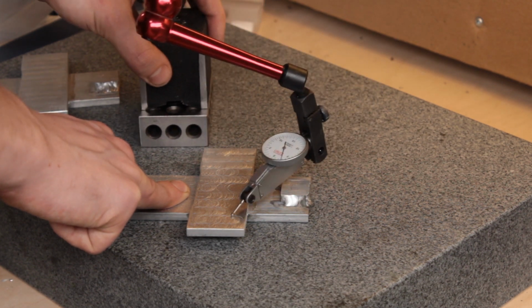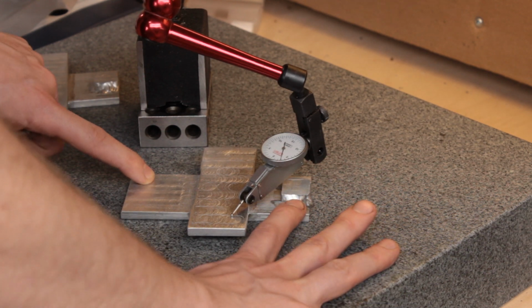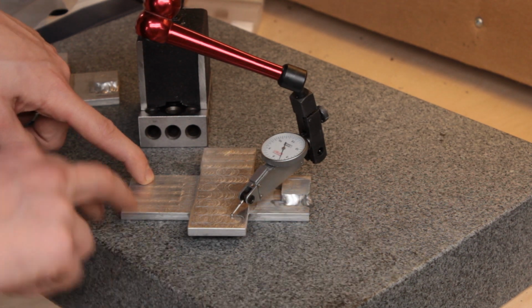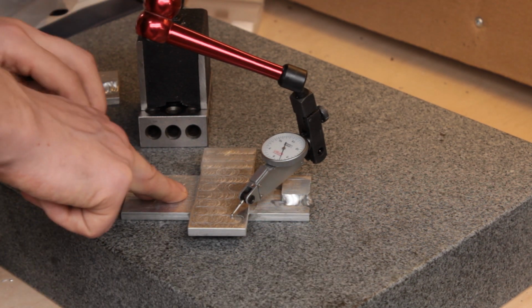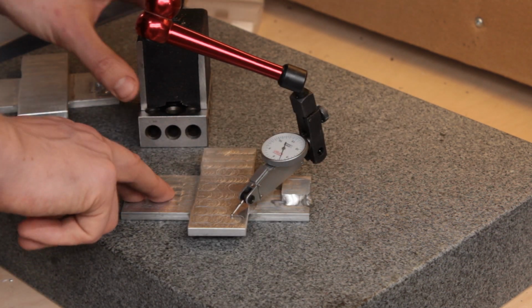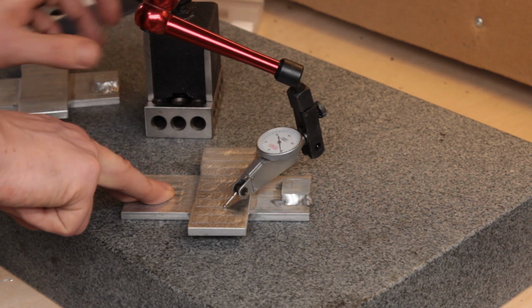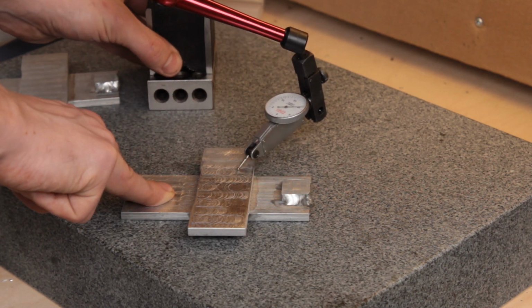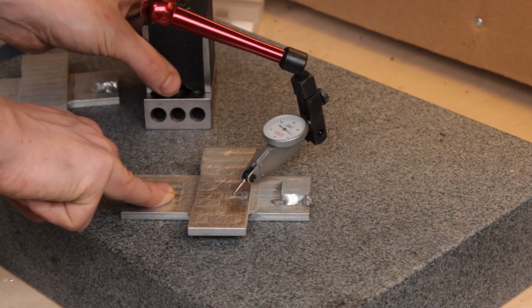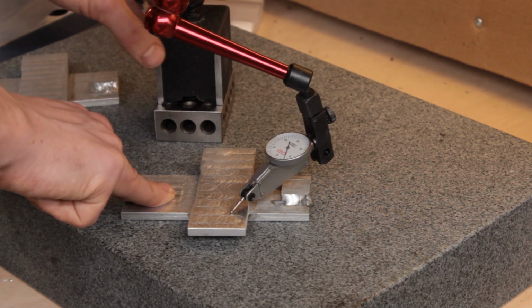These two are at the same height, but during the milling process it looks like this has rocked under pressure, because it looks like this rear plate is now slightly banana shaped due to the heat of welding. Obviously this was flat out at 200 amps because it's 1/4 inch material, so even with the cool down periods that I gave it, it really needed more clamping or something.